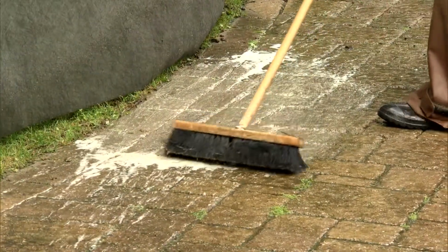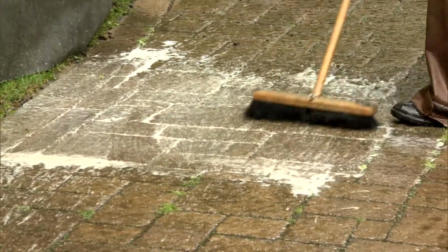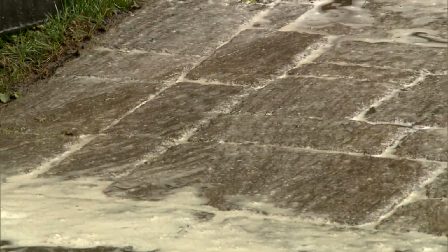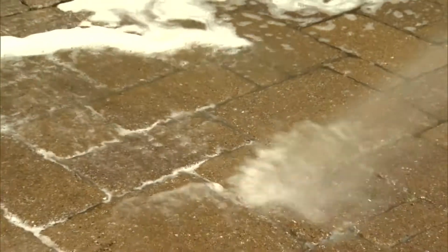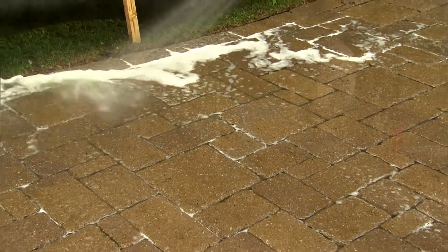With the help of a hard bristle brush, scrub the sprayed surface in 75 feet sections at a time. When the surface has been properly brushed, rinse the area in order to remove all traces of the cleaner. There should be no traces of foam left.